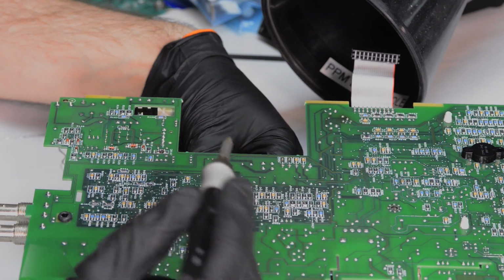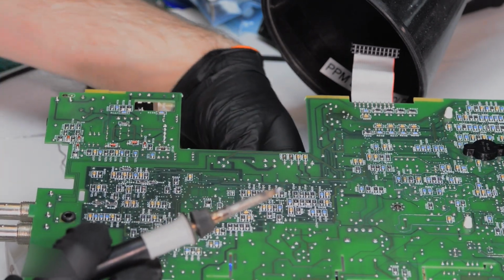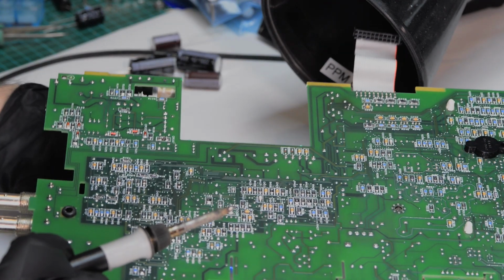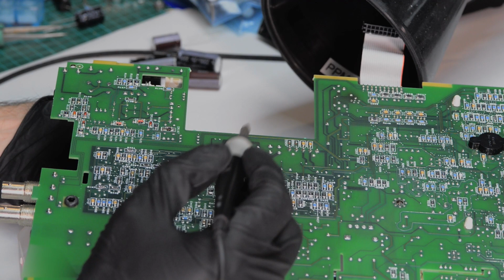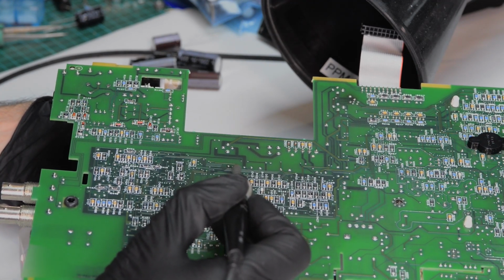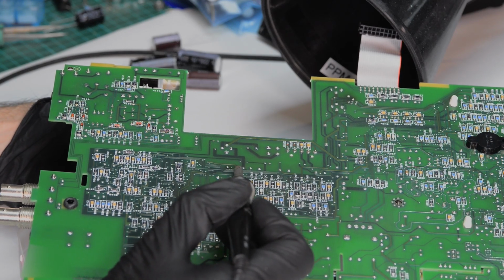Hopefully this information can help beginners who increase temperatures to some crazy above 300 degrees centigrade when components do not want to desolder well, and mostly that is because of small fine tips used or underpowered compact soldering irons like battery powered irons and stuff like that.